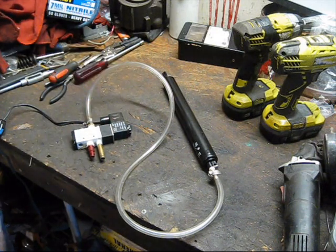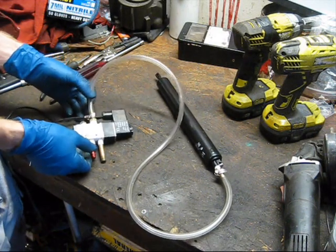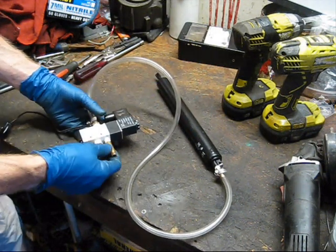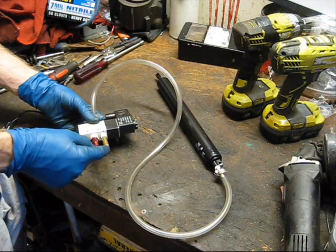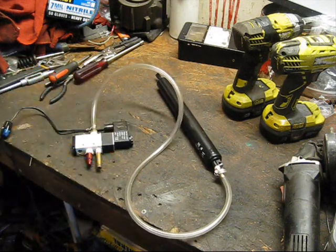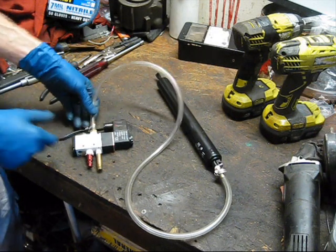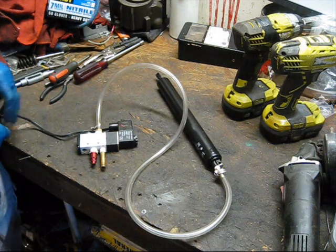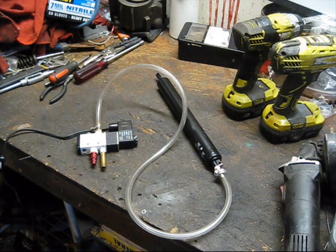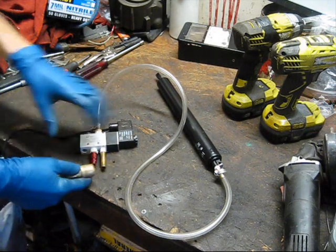The test rig is now plumbed up. I managed to scavenge some tube — probably not the best tube for this purpose, but it will do for now. Just like I said: air source coming in through the P port, A port's blocked off, B port leads to our pneumatic cylinder, and the S port is our exhaust. Unfortunately I can't get anything to fit on the exhaust port without interfering with the air coupling, so we're just letting it dump straight to atmosphere with no restriction right now. I found a nice little plug with a switch on it, and the solenoid has a little LED to let you know when it's actuated — so I can turn it on and off without having to unplug it. You will hear some hissing because the coupler on my air hose is worn out and starting to leak, but we can still demonstrate how it works.